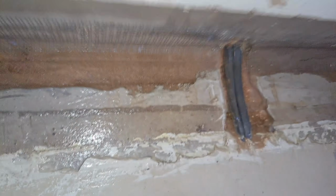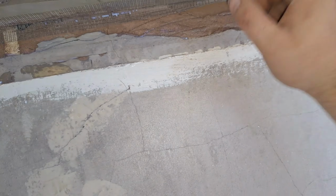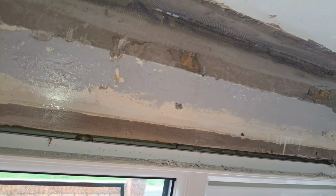That's it now. Very flush. All this has been well sealed with SBR. Sand and cement, once it's fully dried out like this, is super high suction, so the SBR will work a treat on that. And we've also scrimmed the ceiling line, because what you find is when you take coving down, usually behind where you took coving down, you never bothered scrimming the ceiling line because the coving would cover any crack. So when you top coving out, make sure you always put some fibre tape in.